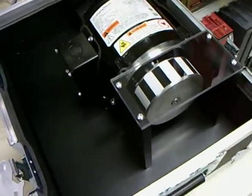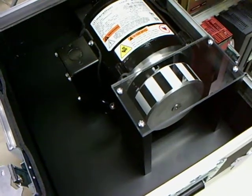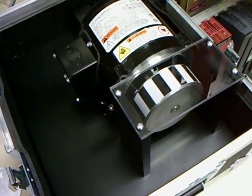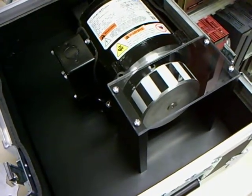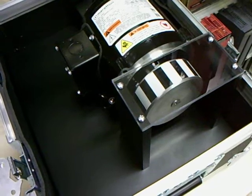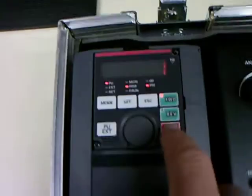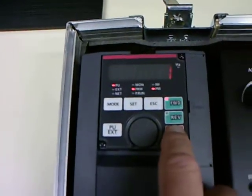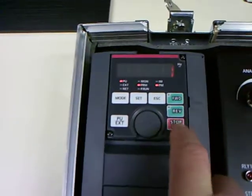You can see here the motor being interrogated. The shaft does not actually rotate. When it stops, you know that the tune has been completed. At this point you must press stop before you try to run the motor, otherwise absolutely nothing will happen. Press stop.